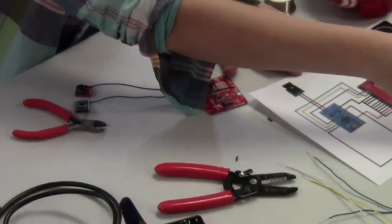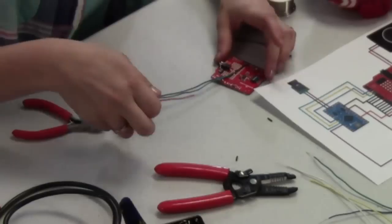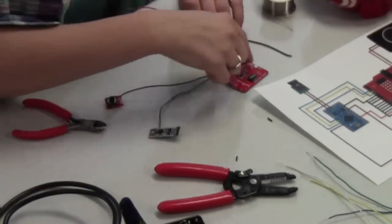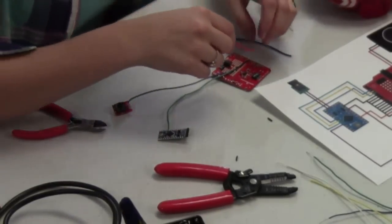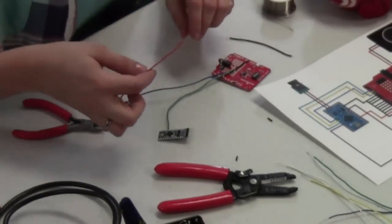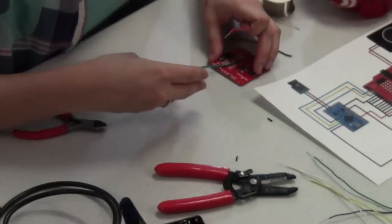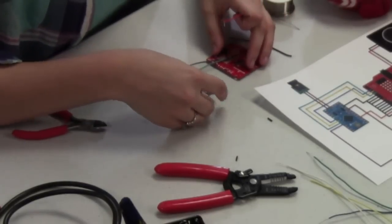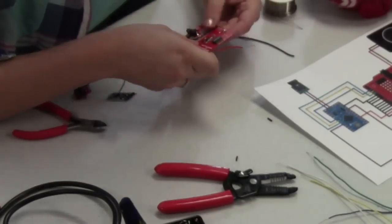And we have it wired, so on the Fritzing diagram, it's just kind of showing a connection into a 5-volt line. There's a lot of different ways you can do that. You can run the 5 volts between your Arduino and your shield, and then run a jumper wire from the shield over to the prototyping area, or however you want to do it. So again, there's different ways you can run this to customize it. It's up to you guys. And I think while we're doing that, we're going to actually run, and this wire should be long enough.